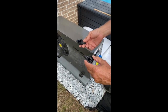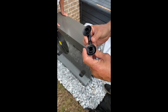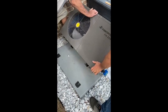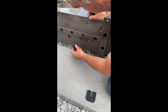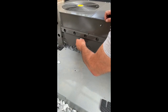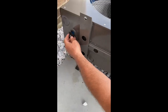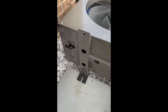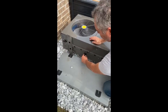These are drain adapters that go underneath the heater — they direct the condensation water. Put the heater on its side and look underneath: there's one in the middle, it basically snaps in. The other one is at the far end. You can stick a piece of hose on it and direct it anywhere you want. On the FH55 model you have two drain holes; on the smaller models you only have one.